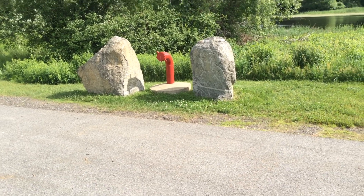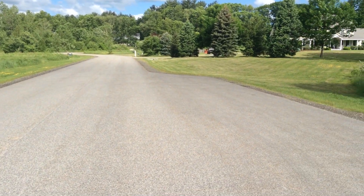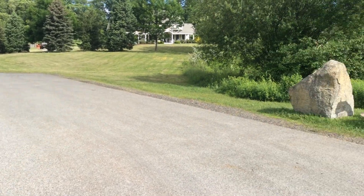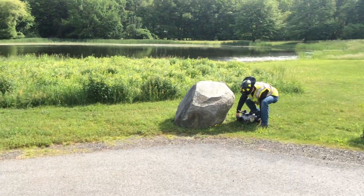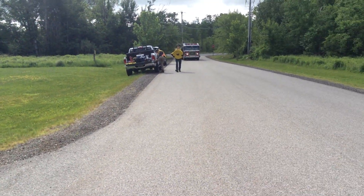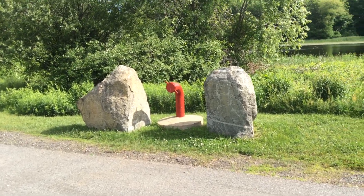So we take a look at this site — they've done a good job. This is prepared back in a small cul-de-sac. They have a pull-off point for apparatus, they have the dry hydrant head protected, and everything is lined up really well to be able to support a dry hydrant tank refill site and water supply operation.